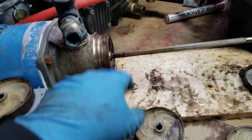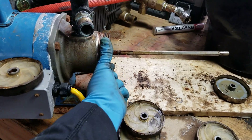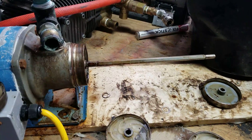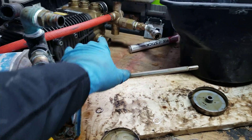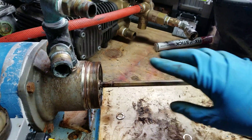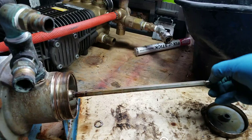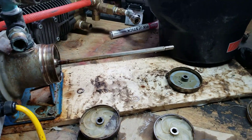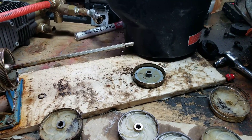We'll also check the o-ring — that looks fine. We'll clean out the threads here. Remember folks, with the booster pump it is reverse threaded, so it goes counterclockwise to tighten. When you're taking it off you just need a little bit of torque to loosen it, and then from there you should be doing the rest by hand. That's pretty much it guys.